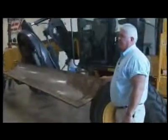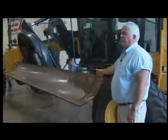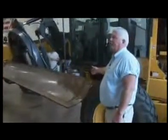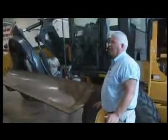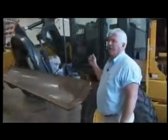Then a lot of times it requires a warm-up. The machine might need to be started and warmed up when it's safe to do so, making sure everybody's out of areas. With this blade being in the bank position and a service position like this, it's a pretty good opportunity to get pinched here if you would get up there and start that machine, maybe crawl out and decide you're going to grease the machine and get in between places like this. It's an opportunity if somebody crawled up on the machine thinking they're going to help you and could hit the articulation lever, could hit a blade lift and pull that into you. So you've got to be thinking all the time about where your implements, where your tools are, and who's around while that engine's warming up.